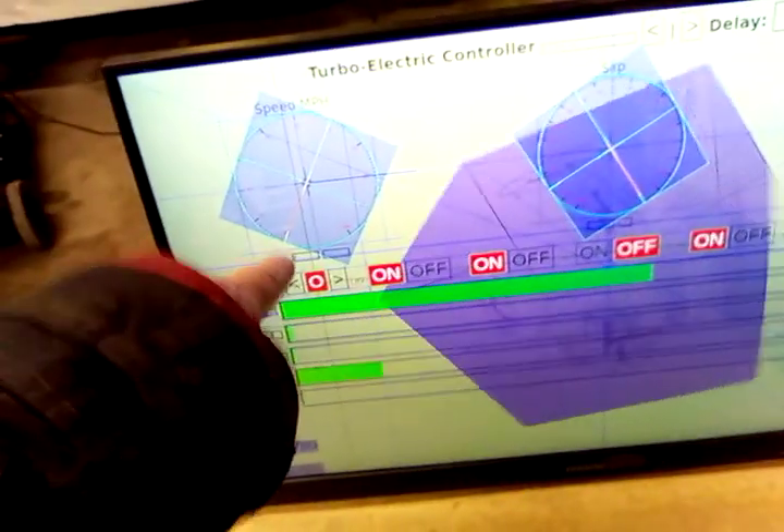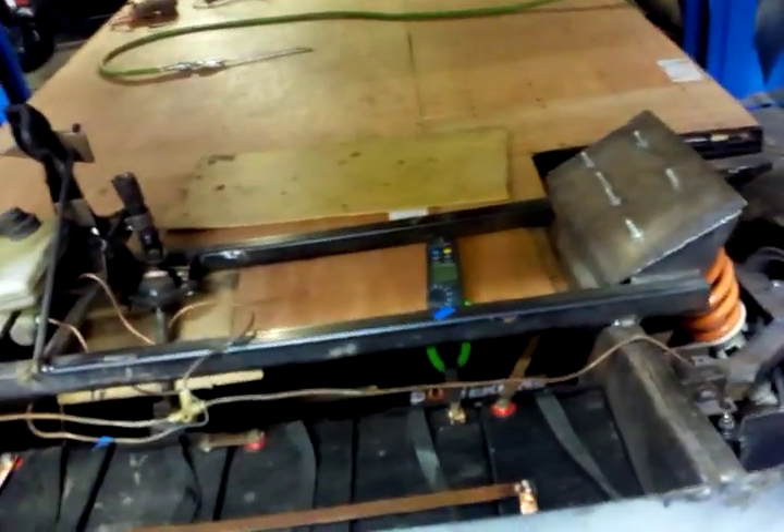I was really taxing it — on the meter when I started blowing the power packs I had it running at about three miles an hour at low frequency, and the ammeter was showing about 40 amps, which is about 20 horsepower at three miles an hour. I'll have to work out the actual torque value — you factor back into torque by dividing power by speed. It's obviously very high torque.